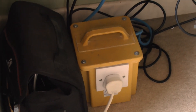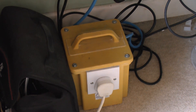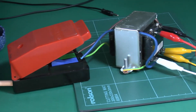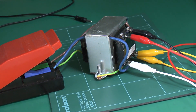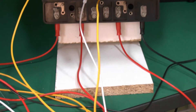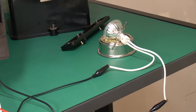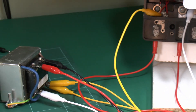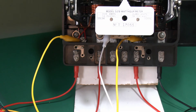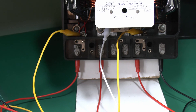If anyone's considering doing this at home, bear in mind that this is running from an isolating transformer on the floor to avoid coming into contact with the mains. The cable comes up into a quick connect. That transformer is being used to supply about 4A of current, and it's also tapping off 240V. The voltage wires into the meter, and over there is that little 12V lamp which provides about 4A of current, while the voltage on the yellow ones is 240V, which provides the voltage sensing.